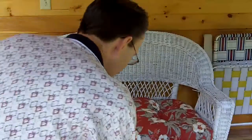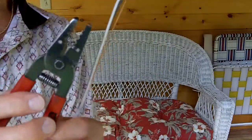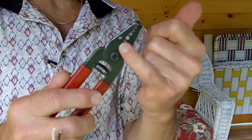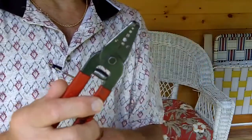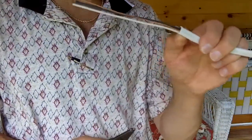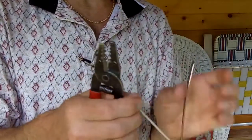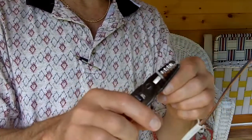I'll show you these strippers here. You'll see the different size holes — each is for a different size wire. If you choose the wrong size hole to strip your wire and pick one that's too small, it could nick the bare copper, and that's not a good thing. So you want to know what size wire you're using. This happens to be 14 gauge, American Wire Gauge — 14 AWG. So you take your strippers, look for the size 14 hole engraved right in, and strip that off.